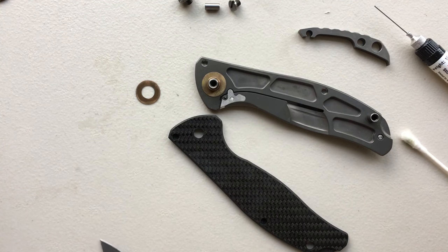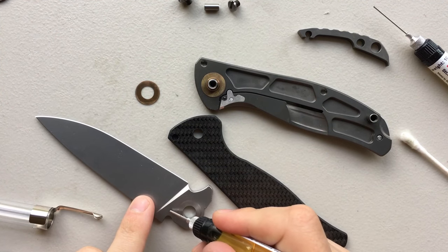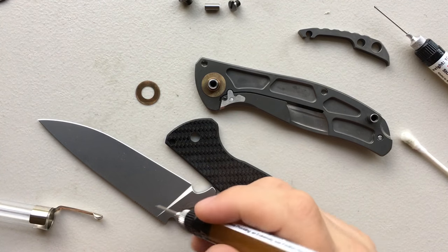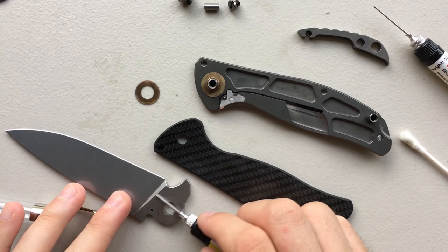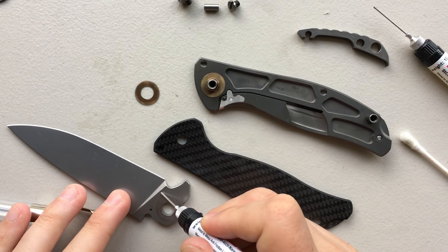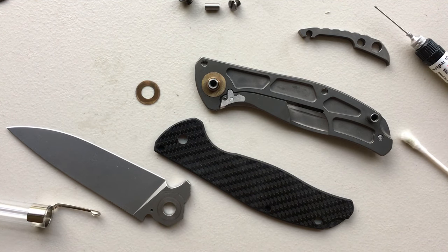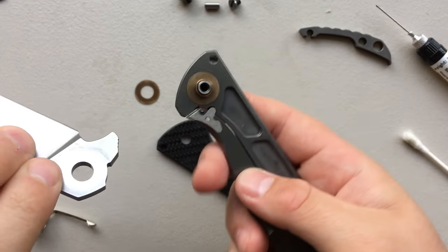The other thing I've got to do is use a little bit of heavier-weight nano oil. I'm going to fill up the detent hole here and spread it along so the detent ball will slide a little smoother along the blade. I use the heavier weight just because I get better luck generally with a heavyweight oil on the detent ball.